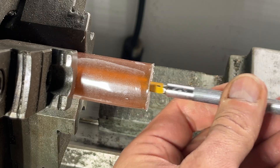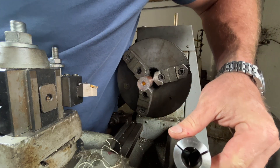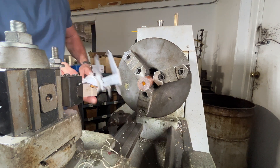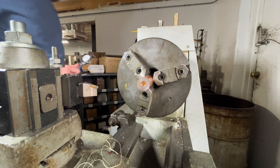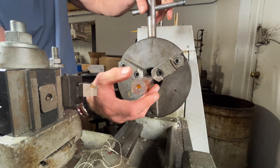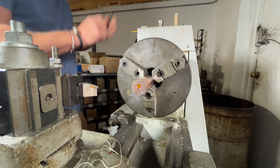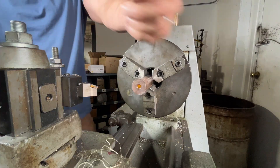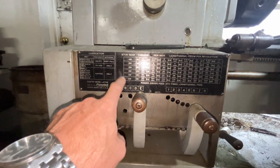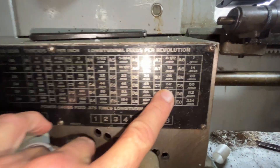It's a little snug fit right at the bottom. Now when we're going to put in the set screws, I'm going to hold it with this 5C collet, which is 13/16ths. Our stock is basically one inch. So the first thing I'm going to do is turn down this front section to 13/16ths. The length of the handle doesn't really matter much for me. I just need something that the tang is not going to dig into my hand when I use it. Let's rock and roll. I'm going to set my feed rate — I want to go about 6 per rev, so I'm going to set it here to C7.